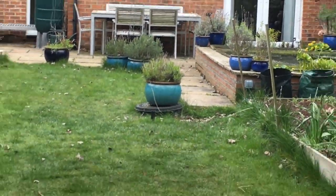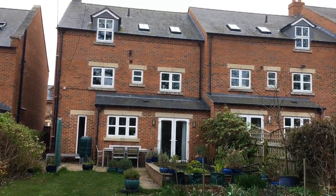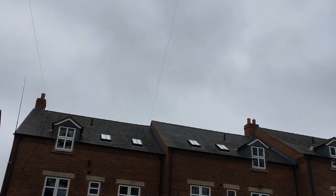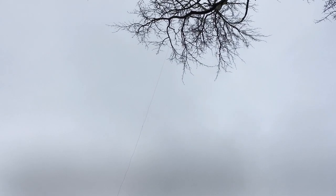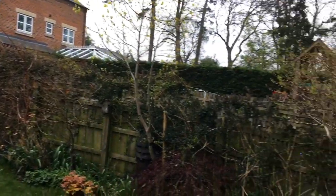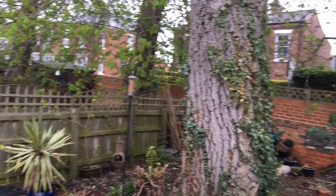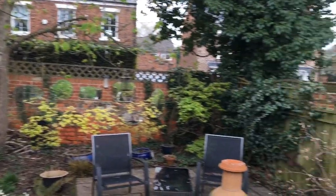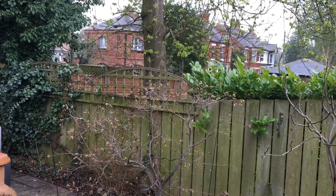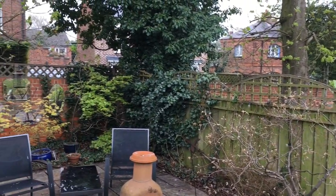Clearly I happen to have a very large tree at the bottom of the garden, but you could use another DX Commander pole, or one of Callum's seven metre poles, or any telescopic whip, and just run it down to the fence like I did. It ran along the top of these bushes, only about six to eight feet high, down the garden, around the bottom, and came right the way around and terminated with a fold back. So even with a low height you can still make it work.